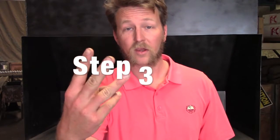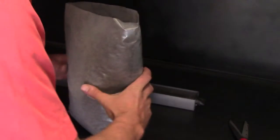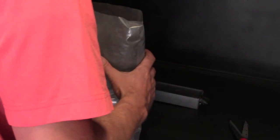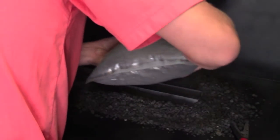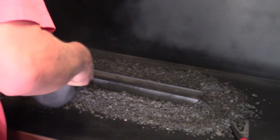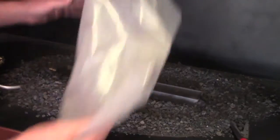Step 3: we're going to use our lava rock and glass medium to make a beautiful foundation for your firebox. The quantity of lava rock and crushed glass depends on the size of the unit you ordered. This demonstration is being done in an oversized testing unit, so the medium will not be spread to the side walls as it will be in your firebox. Spread the lava granule foundation around evenly. The burner cradle should extend about one half inch above the surface of the lava rock to leave room for the glass covering layer.